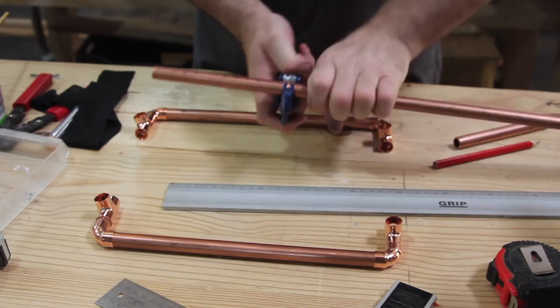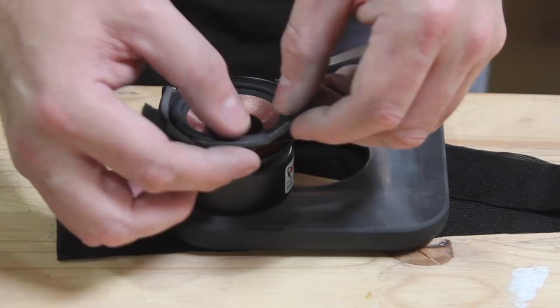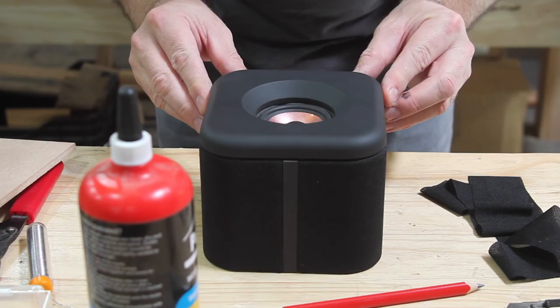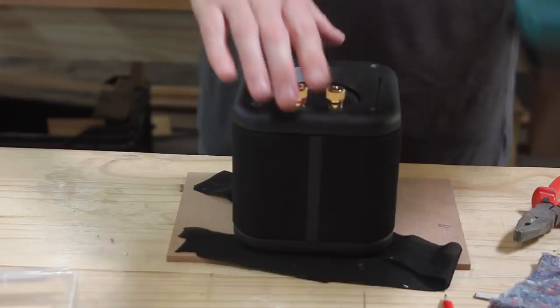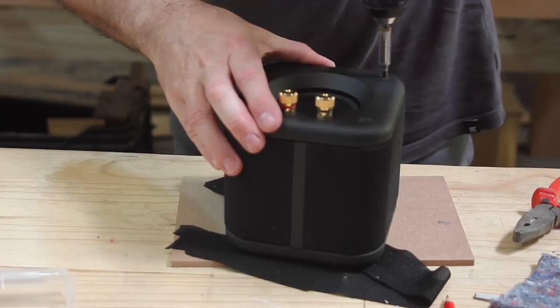Many of the design decisions I made were for aesthetic purposes rather than for improving sound quality. When you consider the small 2-inch driver that I'm using, you can't really expect this to be the ultimate in sound quality. I did, however, measure the specs of the driver so that I can determine the correct enclosure volume, which is roughly 1 litre. The passive radiator in the back is a 3-inch size and is there to help fill in some lower notes in the frequency spectrum. However, I'm probably not reaching much lower than 70 to 80 Hz roll-off in the bass section.